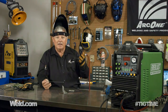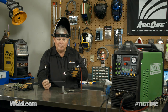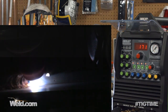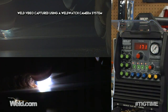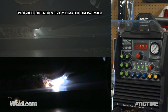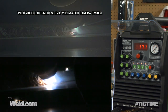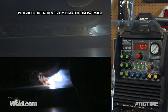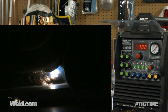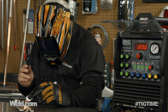Next we're going to test the high end — quarter inch thick aluminum — to see how stable the arc is. I'll put in about 180 amps and see how it works. I'm using a torch that only has 150 amp capability at 60% duty cycle, so you can see it still holds up — you can use it for short runs. I'm using 3/32 diameter tungsten. I'm pegged out right now — it's the max I can get out of it and it's struggling a little bit. I'm going to taper off to about 20 amps. That weld is done.